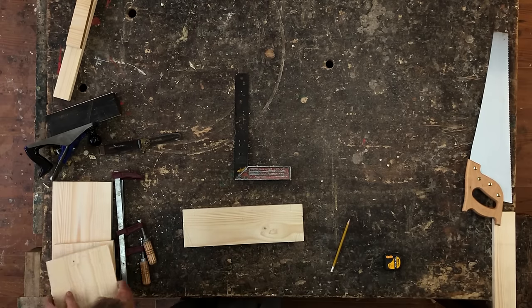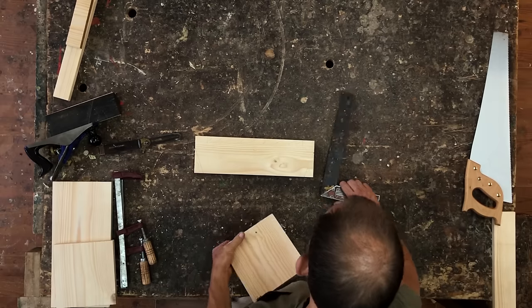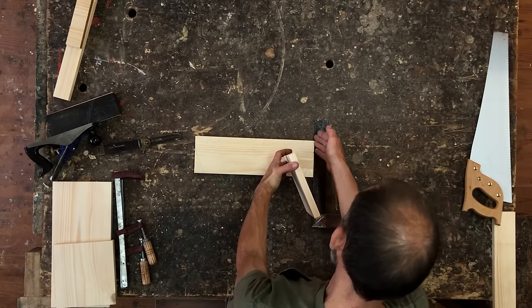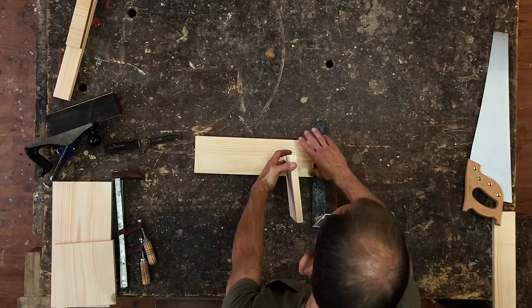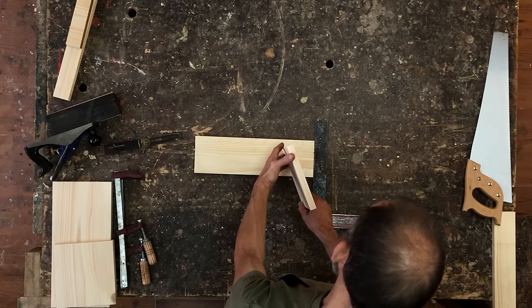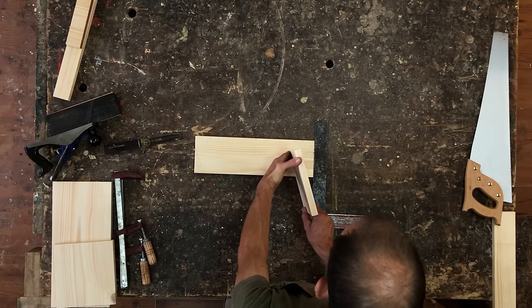And then we need the position of the legs. Now, I would like the legs to come out in line with the end of the stool. If I put the legs somewhere in like this and someone sits on the end of the stool, it can tip over. So again, this is just approximately. I think my legs should go something like this, maybe a little bit less angle.